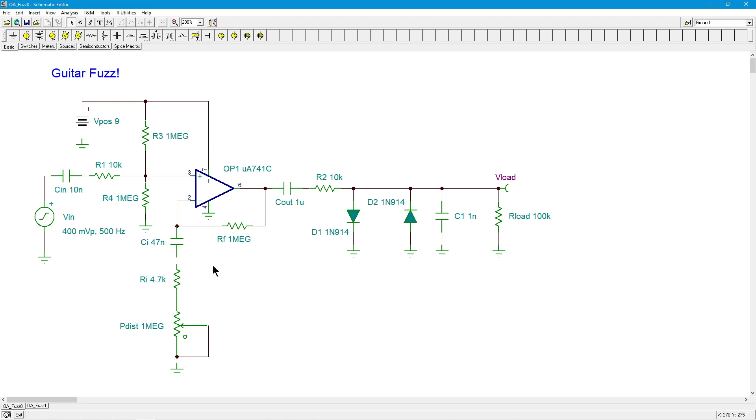We have to make sure that the DC gain of the circuit is 1 - that's what CI is here to do. This opens up at DC, and your gain is RF over RI plus 1. At DC, this opens up and you've basically got RF over infinity plus 1, which is going to be 1. So you have a DC gain of 1. To get the DC bias value we need, we throw in a couple of 1-meg resistors over here. That splits the 9 volts in half, so I get 4.5 volts here. The impedance into the op-amp is high enough that we'll have minimal loading effect, giving us 4.5 volts at the minus input and 4.5 volts DC at the output at pin 6.